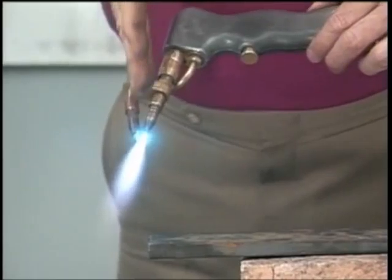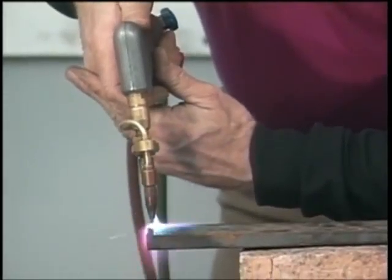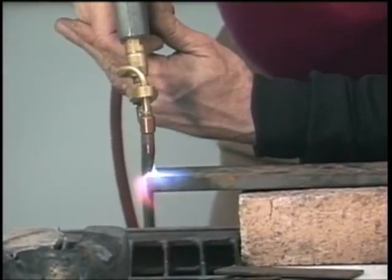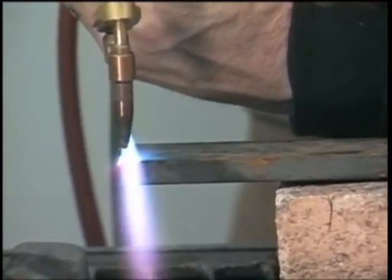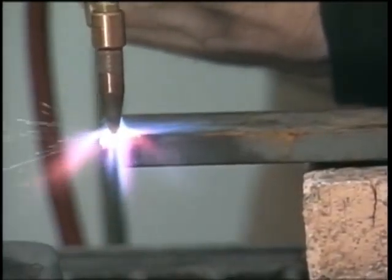Also, make sure you got that same gap. Make sure that your tips are lined up just like your undercutters. All right, just sort of come in here and knock the chill out of that metal. Don't take but just a second. Now keep that little cone just up off the metal until it turns red, keeping that copper tip straight up and down.